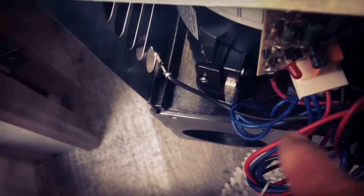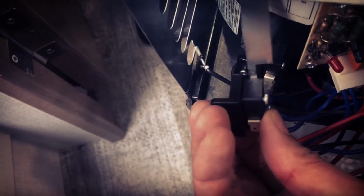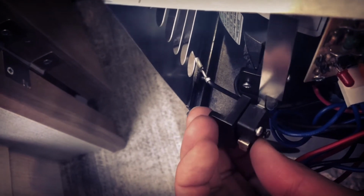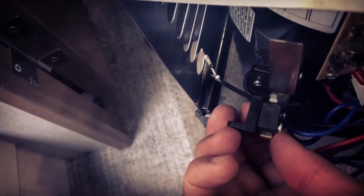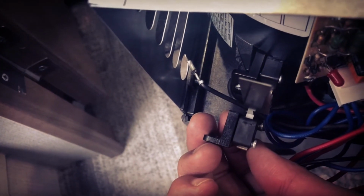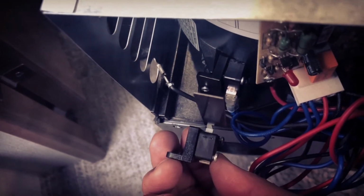And so I had to go in there and make sure that this, so this is the sail switch now that's in there that I replaced. See, it's sitting in there just like this, okay? And so I had to orient this thing, I had to tilt it this way, and then pull it back just a little bit like that, so that the wind would hit it at just the right angle. And that's finicky. So as frustrating as that is, that's the resolve to this thing.